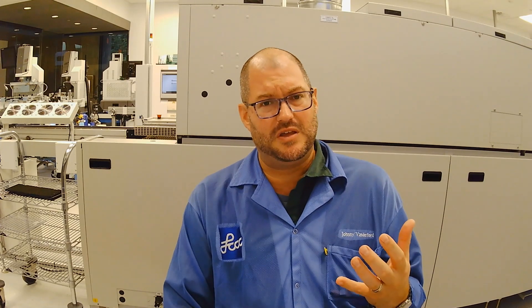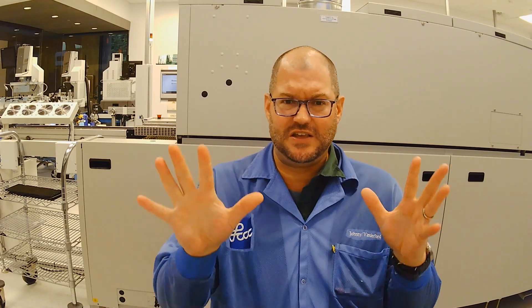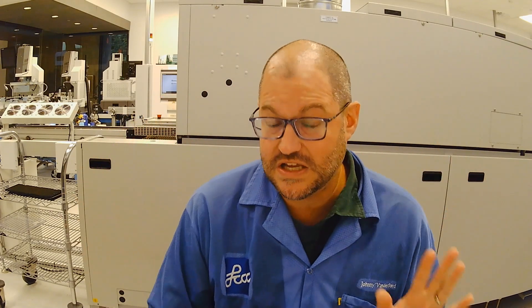Step five: you've got to know your electronics. There is a chance something may be electrically wrong with it. The use of a multimeter is extremely important — measuring voltage, measuring short circuits, measuring open circuits within the circuit. Current measurement requires breaking the circuit open, and none of us want to break a circuit further than it's already broken. The only current we typically care about is the amount being regulated to the entire thing — if there's more than that, there's something deeper wrong on the inside.